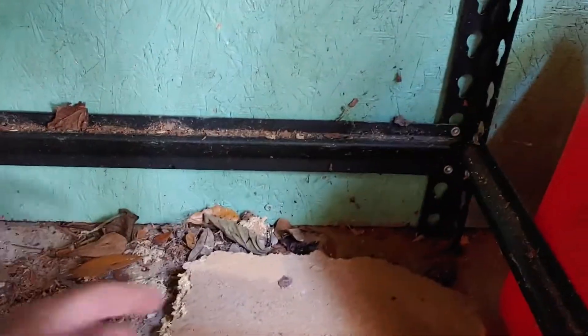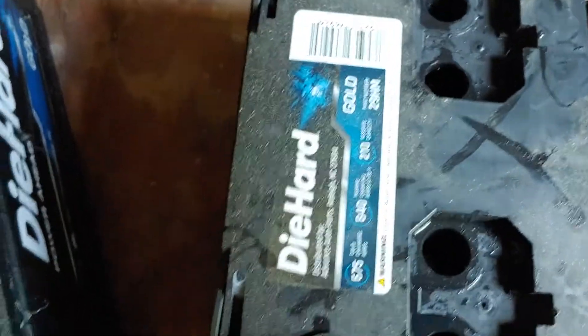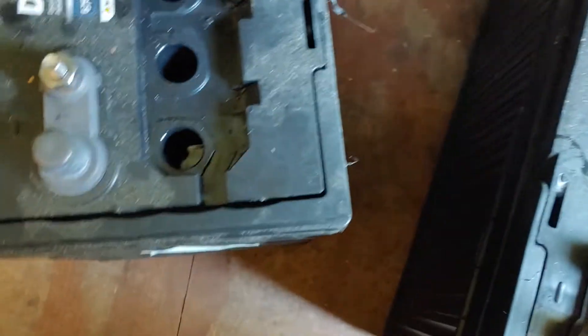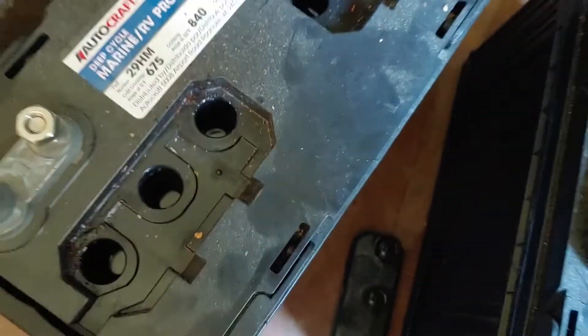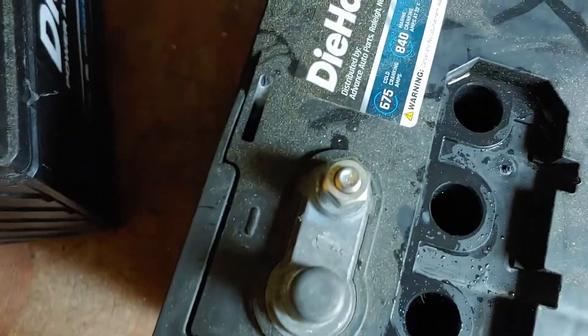Not sure what caused it. It may just be that in the long run the batteries were way too much weight — the weight on the boards might just have been too much. Now, unique opportunity here, right? I will get a chance to clean all the batteries up, which they need. Check the water — as you can see I've already been doing that. Most of the water looks pretty good though it does need to be cleaned up a little. These flooded acid batteries desperately need to be taken care of, or you will damage the battery.